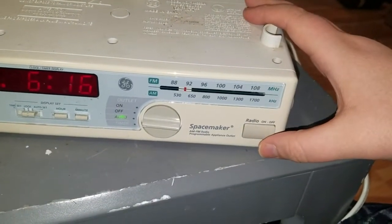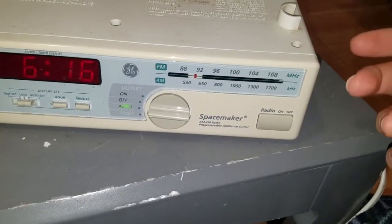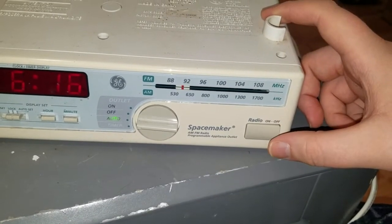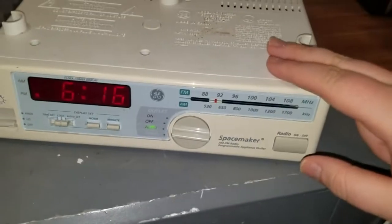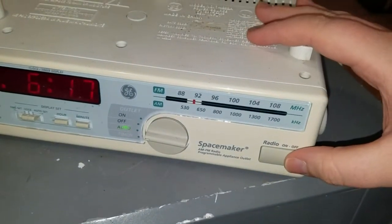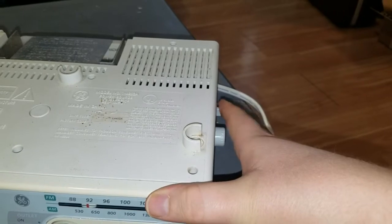The radio switch is a momentary micro switch push button. What'll often happen is you press it and you hear the speaker pop like it's turning on, but then nothing comes out. I think it's turning on and then immediately turning off — I think the switch is bouncing. It works like 75% of the time, so that's probably just a dirty switch. The AM/FM switch is also a little hairy. I'll give that a spray down too.